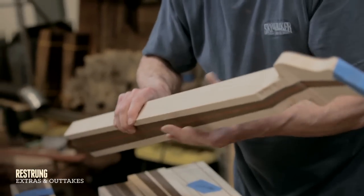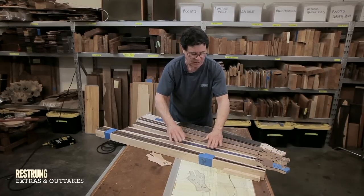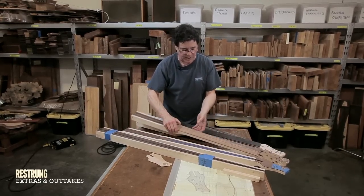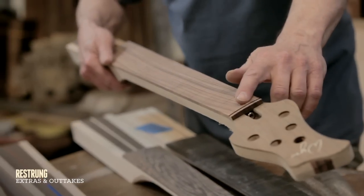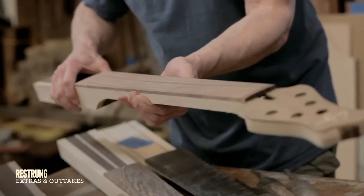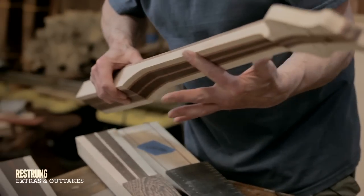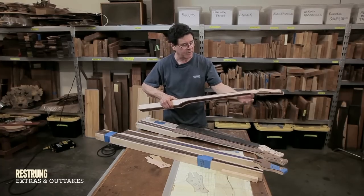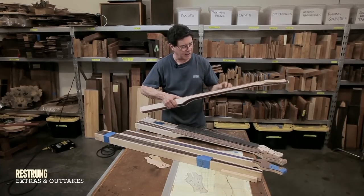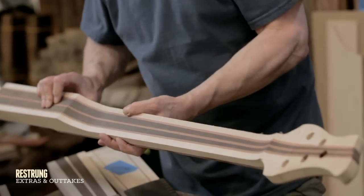The next step — it's still just a square block. I'm going to glue the fretboard onto the neck so that my clamps fit squarely. Here's my fretboard — that's all glued on now. The next step is to go to the bandsaw and cut off the basic silhouette. I don't want to hand carve all of that off; I want to lose as much material as I can quickly. So this is the basic thickness of the neck after it's been cut away.